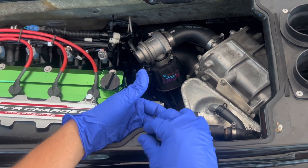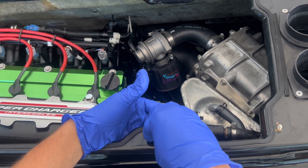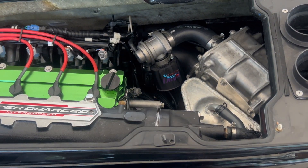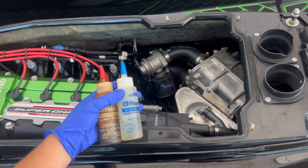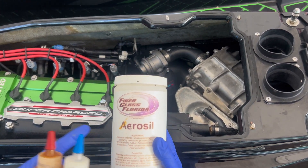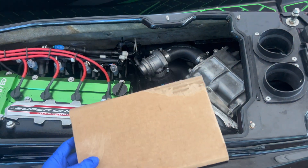I don't want to get epoxy on my good knobs, but if you'd rather use a clamp, you can use a clamp as well. So first we're going to mix up our two-part G-Flex Epoxy. We're going to use the G-Flex, and then to thicken it up a little bit, I'm going to toss some aerosil in there. I'll mix that up right here for you guys.